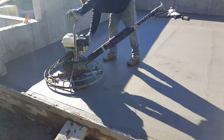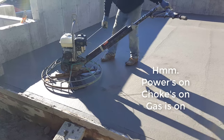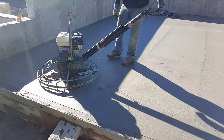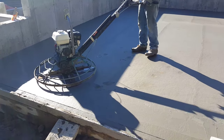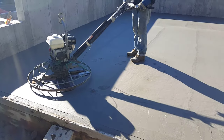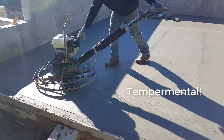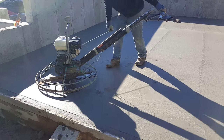So we feel the concrete, it feels good and firm. We can walk on it. We're only sinking in maybe about an eighth of an inch. But sometimes the concrete's a little deceiving based on the weather. This was late in the fall, it was really cold, but the sun was out and the concrete felt pretty firm. Now Darren's trying to get the power trowel - it was so cold the power trowel didn't even really want to start very good.